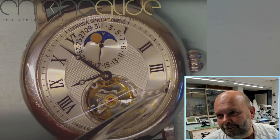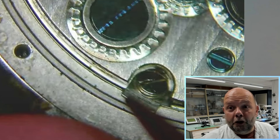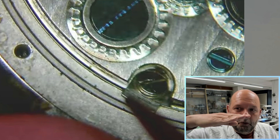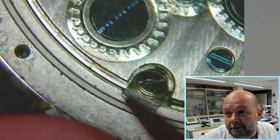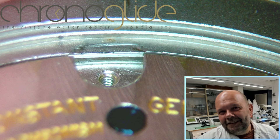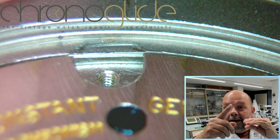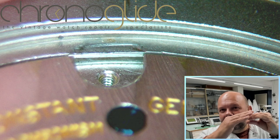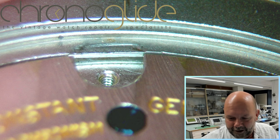Here is the small clip that secures the watch movement in the watch case. During disassembly we already saw that one screw was a bit lopsided, a bit strange, and the broken screw was from the other side. The small clip should be sandwiched in between the watch case, but as you can see here, it was on top. While they tried to screw it on, they made that depression — do you see it? Well, that was the start of my depression.